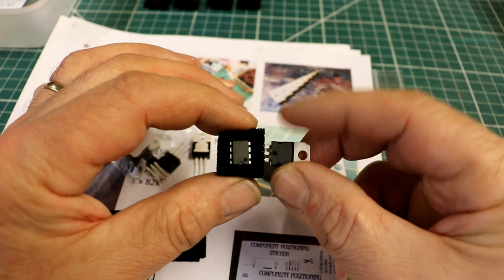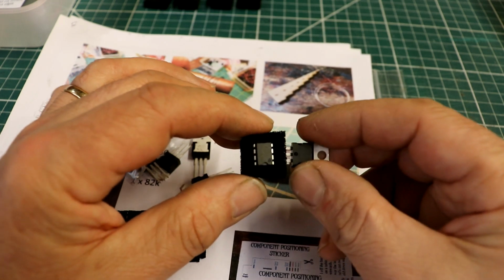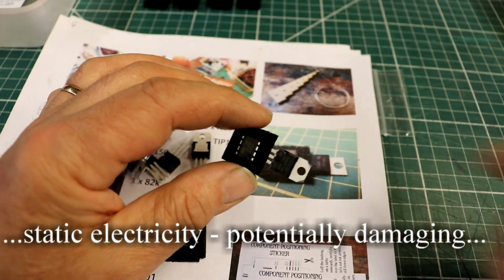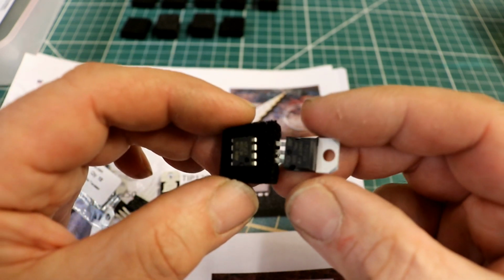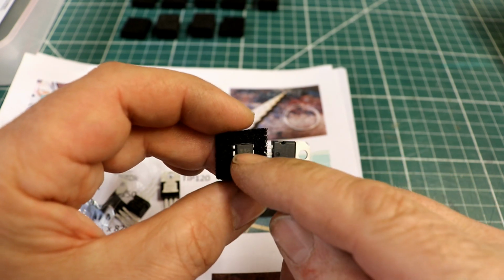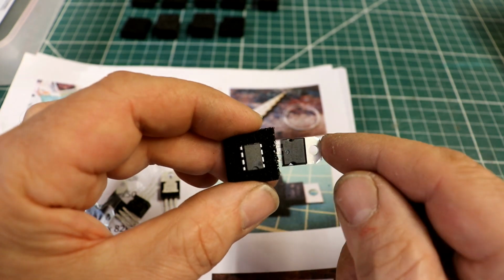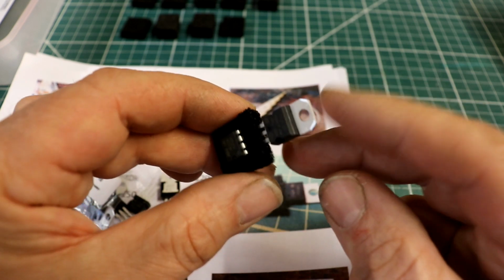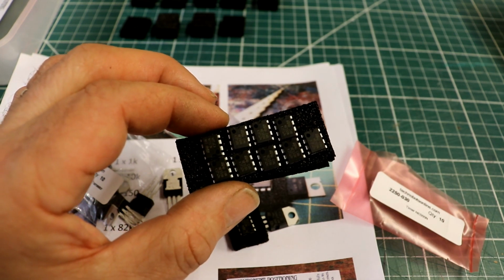So that will keep them safe regardless of the polythene bag they're going to go in, this part of the kit. It could be rubbing around and creating all sorts of charges and things, but this will ensure that they're kept safe. So I'll make 10 of them. And for those of you who know about electronic components, both the Darlington pair and the NE555 timer do have protection diodes across them, so theoretically, if you were to charge yourself up and touch one of the pins, they are protected, but it's just not worth it, just to remove yet another possible problem.